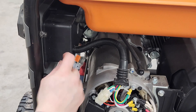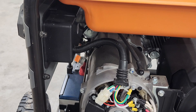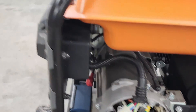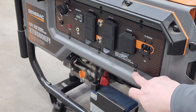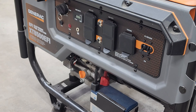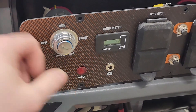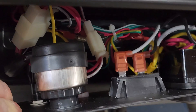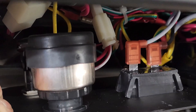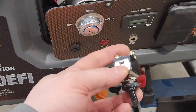In my case, I have this back box with a solid piece of loom going from here into here, keeping everything nice and weather-tight. Ideally I'd fish my new wire up through here and keep it sealed. Taking the front plate off, the box is held by screws all the way around. Looking inside, we can see everything's pretty busy, but we've got a gap right here of adequate height — that's exactly where this toggle switch is going to go.